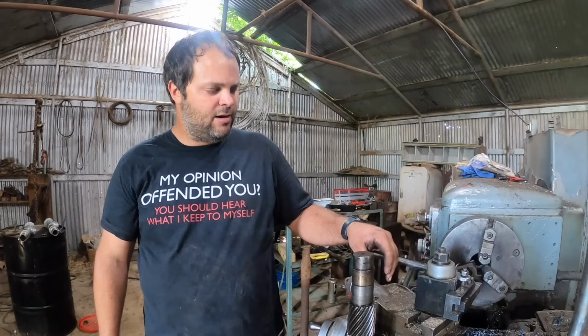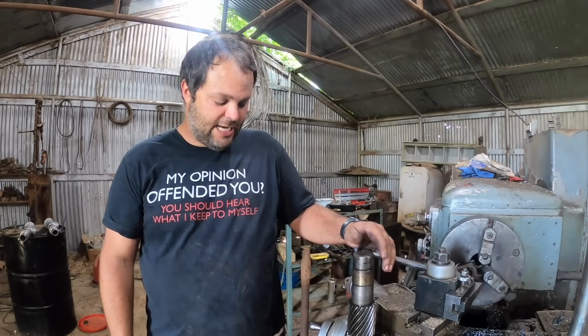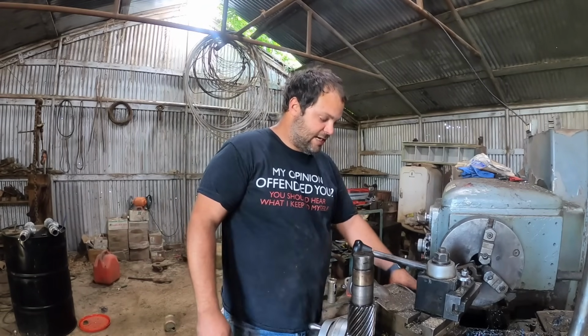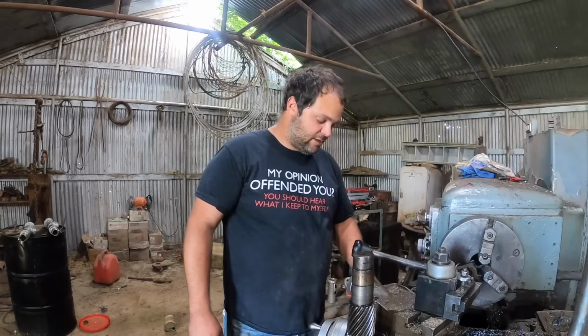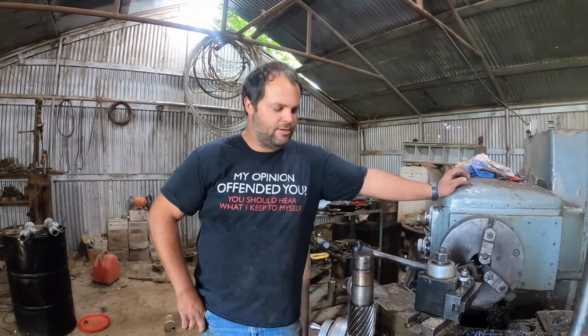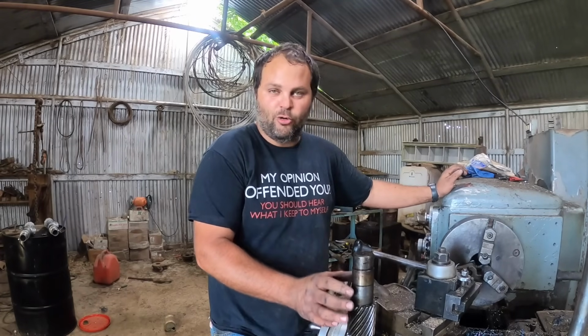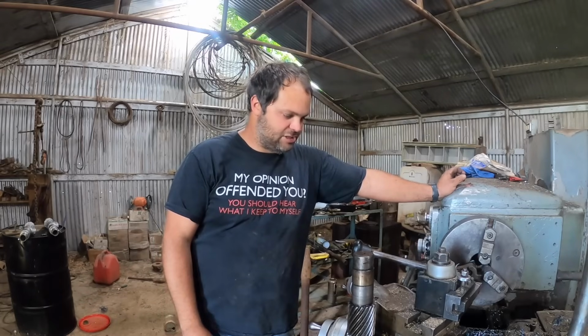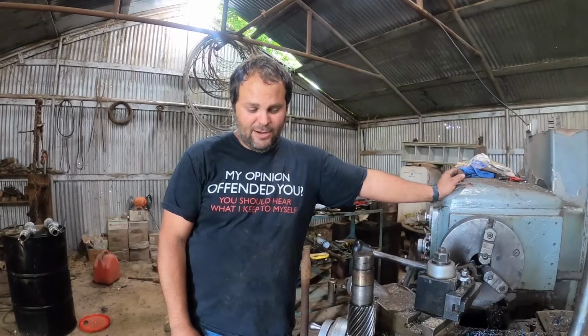I called the guy back that made the gear, and I said, hey, it fell on there, it's too big. And he said, well, let me call the gear shop and see what the spec is supposed to be. He said, but you know, we've got the old Attico books, and we were supposed to have made that to exactly what the gear spec called for. I think what happened, the only thing that makes sense to me, is that gear is supposed to be 1 7/8 exactly bore. The gear I pressed off here was 1 7/8 bore. It was about 1 7/8 and a 1/2 thousandth. And this is 2 1/2 over that, and so we're supposed to have about a 2 1/2 press fit. The interference fit between this and the old gear was about 2. I measured that, and it's about a half over 1 7/8. So I think that he probably cut the gear wrong.